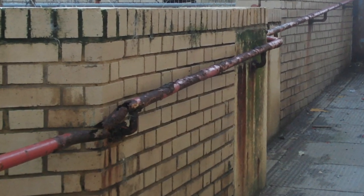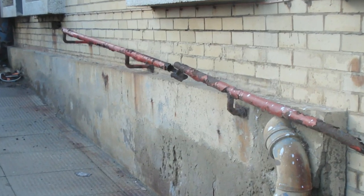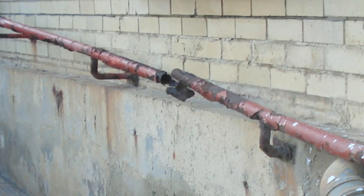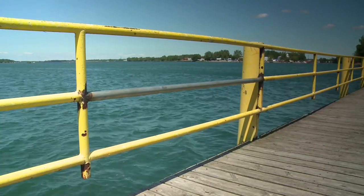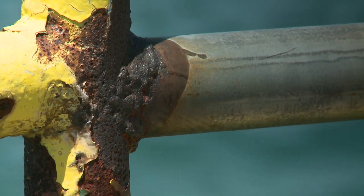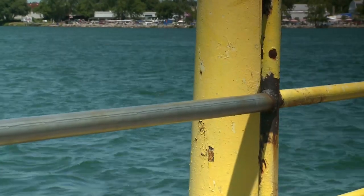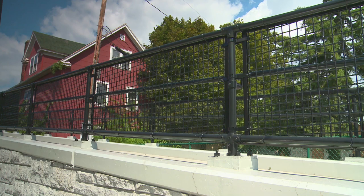As many components of guard railing are hollow, internal corrosion where coatings have been breached is also a major problem, and often not evident until it's too late. Any repair to fabricated rail installations involves cutting out damaged sections and welding in new. New sections need to be prefabricated off-site and transported to the location. So, what are the alternatives to fabricating barriers?